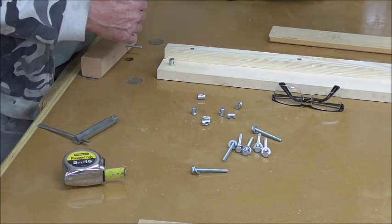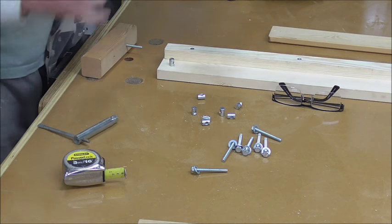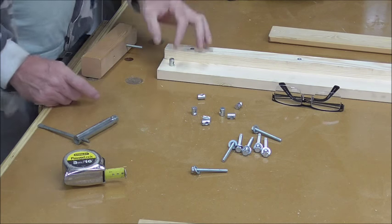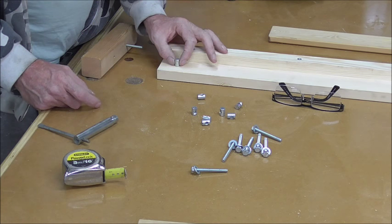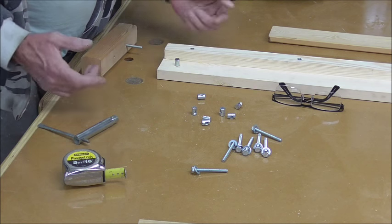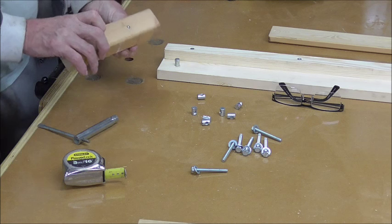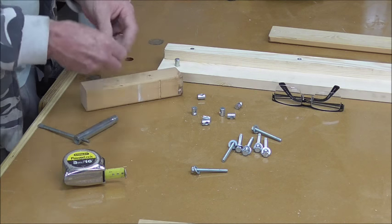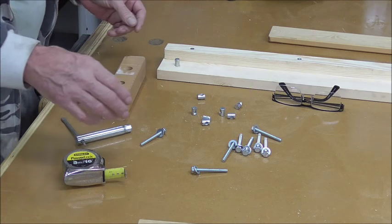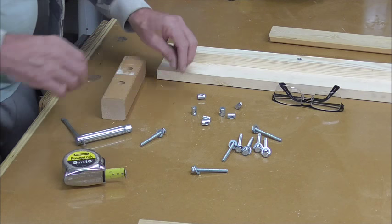And this wood is far too long to upend in my drill press. And then once we've got that, this must be done dead central to that hole and dead perpendicular that way. So again, a few little challenges we need to overcome. But first off, let me drill all the holes from this, nice and simply, on the pillar drill.